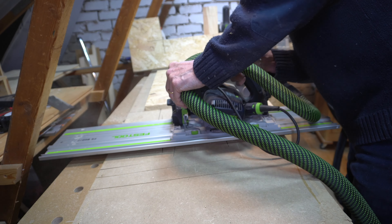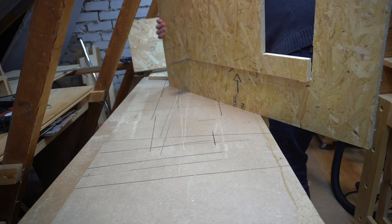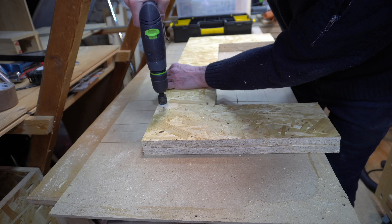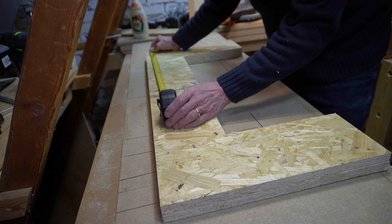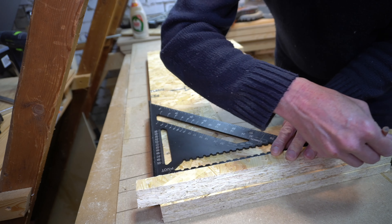To glue the top together I used a trick of using tape around the perimeter to hold the mitre joints together. And even though it may be an old trick, it's the first time I have used this method. I have to say I found it quite easy, even though I used cheap £1 — or today £1.20 — packaging tape from the pound shop.